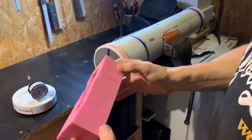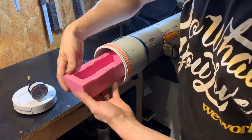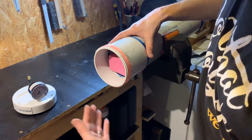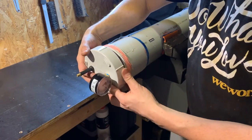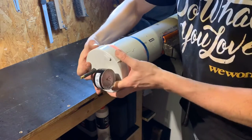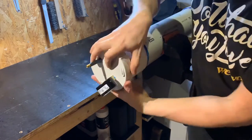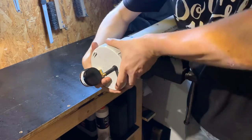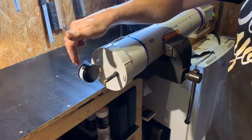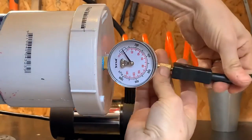I will have cast my resin in here — I'll probably make a caddy so it can sit perfectly flat. I slide it in, make sure it's flat and not tilted either way, and put it in here. It's now essentially ready to go. I get the cap on, make sure my DIY seal is nice and snug in there, put the Teflon tape on first, and then it's just a matter of cranking this thing on by hand. Because it's got the rubber gasket at the top inside, you just crank it as hard as you can. If the pressure gauge is facing the wrong way, I just pick it up and spin it around in the vise — no big deal.